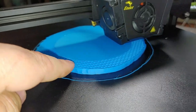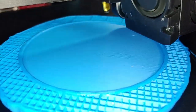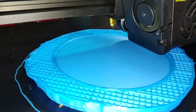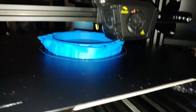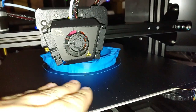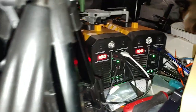There's the second layer — a more complete circle with fewer holes, so you get a better interior surface. The result of that infill choice means the bottom layer is really clean on the inside of the pot. Once I no longer need 25% infill I switch to 5% for the walls — saves a lot of time and filament. Going to bed now. Five hours in, another 25–30 to go. I've been stepping down the heat bed 10 degrees at a time to 40, and now it's off. Thanks to the Wham Bam PC surface, I don't need the heat bed. The printer now only consumes about 40–50 watts.